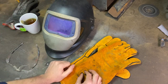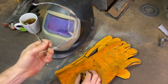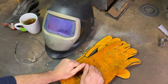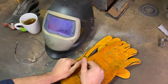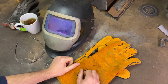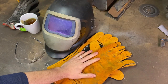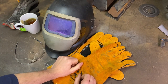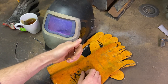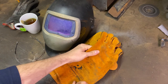To supplement the screen you also want a really good pair of safety glasses - these get left out a lot and I don't understand why, because MIG welding is quite a violent process with tiny lumps of weld spatter literally flying everywhere. The only thing worse than arc eye is getting a molten lump of metal in your eye instead. For gloves, I'd recommend thick leather ones - it's easy to just think you'll put a quick tack in with no gloves on, but the UV and spatter will leave you crispier than a Sunday roast.